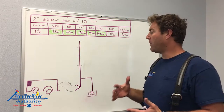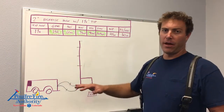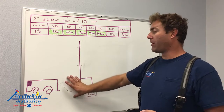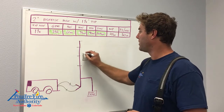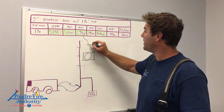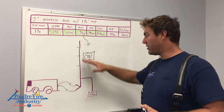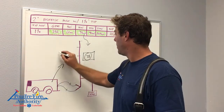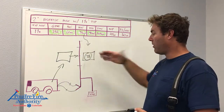Wrapping up this segment on our new high-rise package from the DO standpoint: old-school hydraulics are completely out the window. The 25 PSI for the standpipe, accounting for elevation at 5 PSI per story — all of that no longer exists. The only thing that matters is the pressure on the pressure gauge on the fire floor. If I've got 100 feet of hose going out, that's a 75 PSI target. By bringing the gauge to the standpipe outlet, we're essentially moving our engine up there — I'm operating as a forward DO.